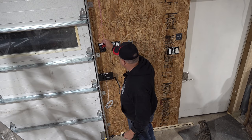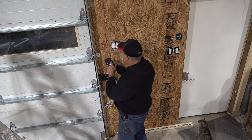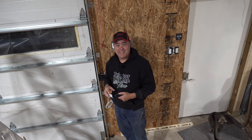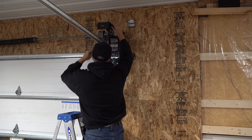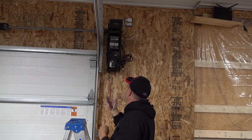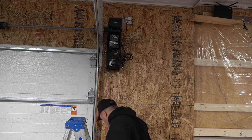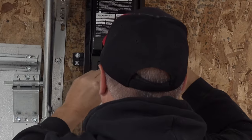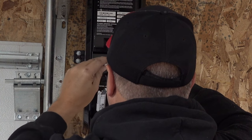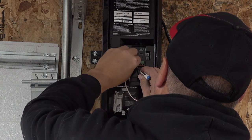I'm going to install this controller closer to the door because I hate to have the wire running all the way across. I tried to have those wires all behind the wall but didn't get everything thought through. These little connectors are really easy to use — I just take the tip of a small screwdriver, push that in, insert the wire, and when I let go it grabs it tight. The control goes into the first two terminals — there's the red wire and the white wire.